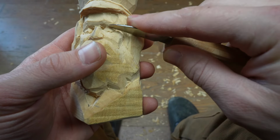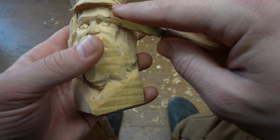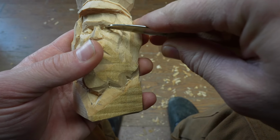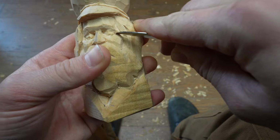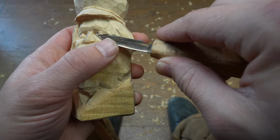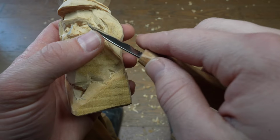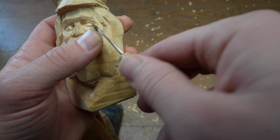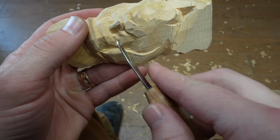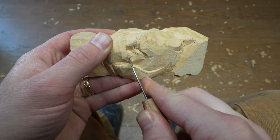This is a little bit challenging, but I'm going to start across the top with a line that starts at the upper corner, up in this corner of the triangle here, and then goes down, not pressing with a lot of pressure. And then a light stop cut up to that point. Not a lot of material removed, just a little bit. That's what I mean by a light stop cut. Just like that, see? And the same thing over here. I'm going to make a stop cut that goes from the inside corner and comes down here, like so.